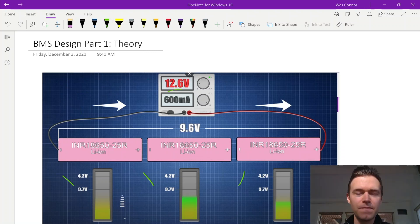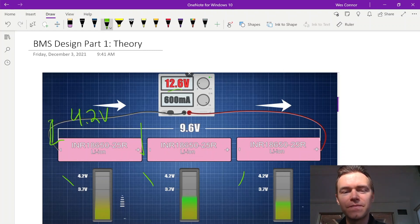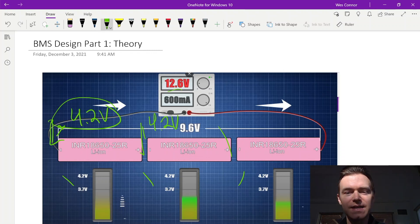There are a lot of ways to do that. We could do active cell balancing where we only charge one cell at a time using a 4.2-volt charger on each cell, but this is relatively difficult and expensive, requiring a separate charger for each cell. It's simpler to use one charger with the cells in a series configuration, as they'd be used in an actual pack, and then disconnect the main charging line once one of the cells reaches 4.2 or 4.1 volts.